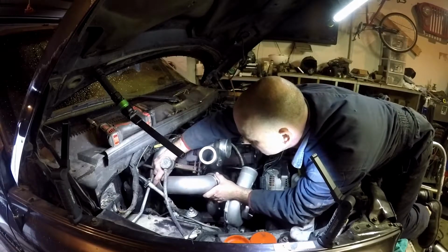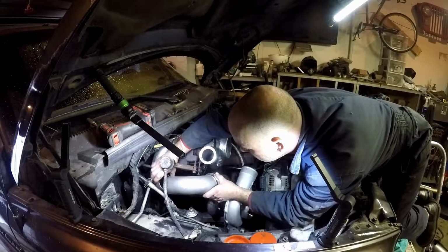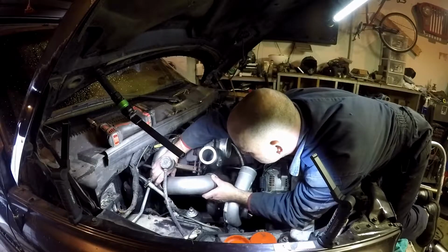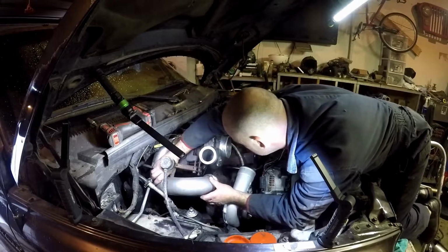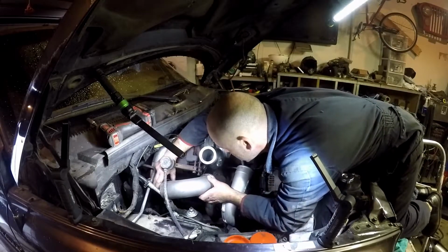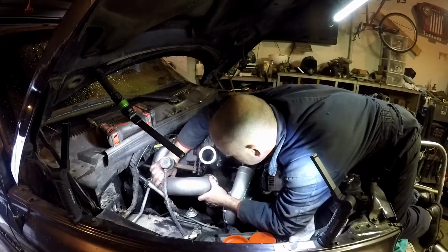Then you just fit a piece in here like this and figure out your rough angle. I like to do some pie cuts on some pieces to get them in there. See, that's actually not that bad right there. It's a little bit too steep of an angle, but it's not very much. I can just trim some off of one of the edges, back off the angle on it, and it'll be okay.